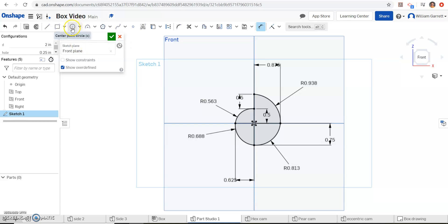We still need to add a hole in the center. So I'm going to hit the circle tool and go right to the origin to make my center — I just click. Then I want to dimension it, so I hit my dimension tool and click on that circle. I'm typing in 'hole' again, so that if I want to change the size I can just change it really easily.